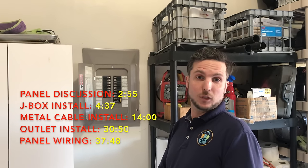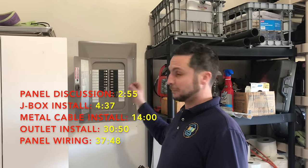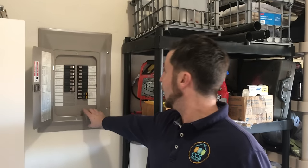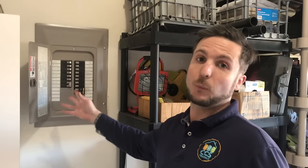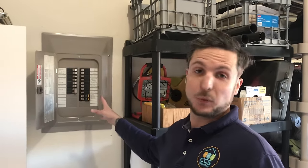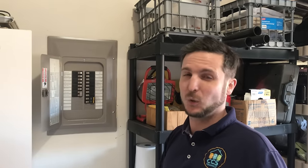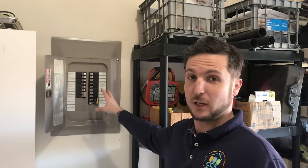We're installing a new 20-amp circuit for an additional receptacle and changing a light. First, we're going to start at the panel itself. I'm going to check the brand of panel I'm going to be working from. This particular brand is Eaton — it's a CH, so it's good quality. I can see that I have additional spaces so I can add the additional circuit breakers I want. When you start to want to add circuits, you have to assess the situation: is the brand of panel in good condition? Does it have the spaces needed? You don't want to be overloading the panel.